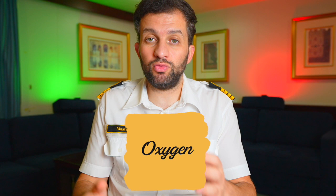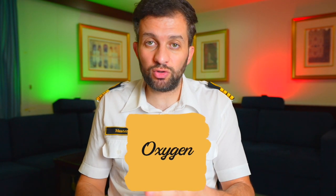The third one is oxygen. We need to remove the O2 from our cargo tanks in order to avoid any mixture with the flammable methane. The oxygen in the air is 20.9%, and for fire or explosion to occur, it requires only 11% O2.